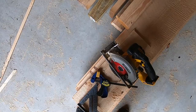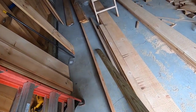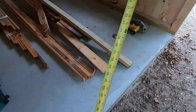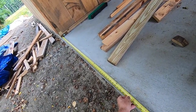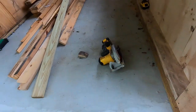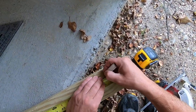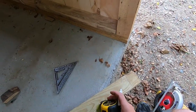We're going to need a square, our saw, and we'll start off with a pressure treated 2x4. That's going to be easier to measure it this way. We need to go right to that sill plate to that sill plate — 91 and 5/16. When you're marking your line, you want to know what side you're marking on and what side you want to cut off.